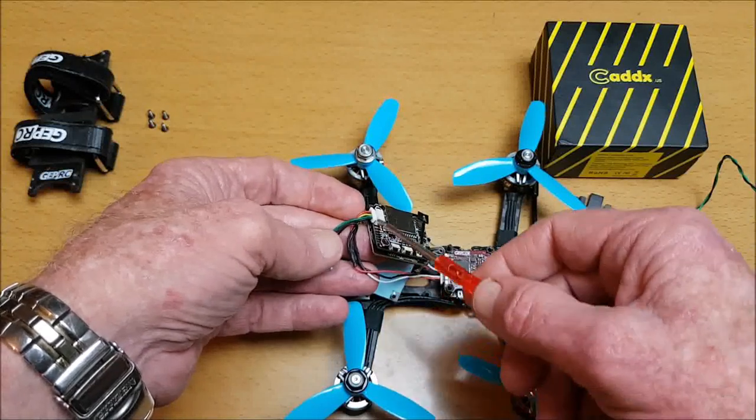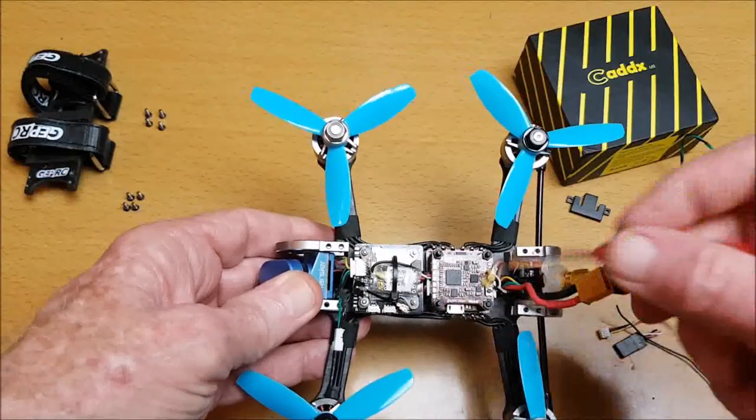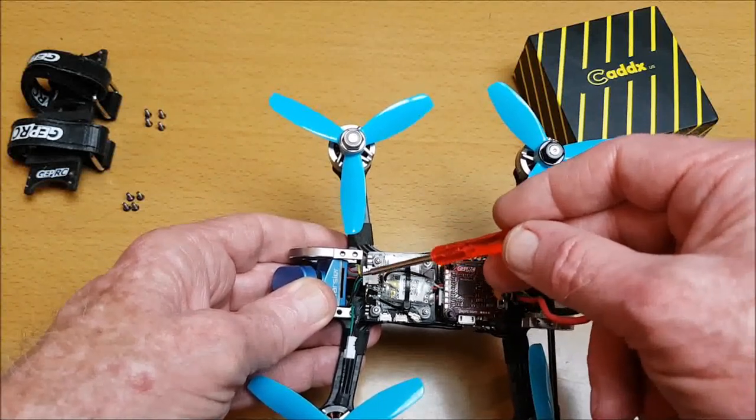And the video cable, the yellow, goes into a white wire here. And then also just make sure the two black wires, the AGND and the normal ground, you also splice in and join together.